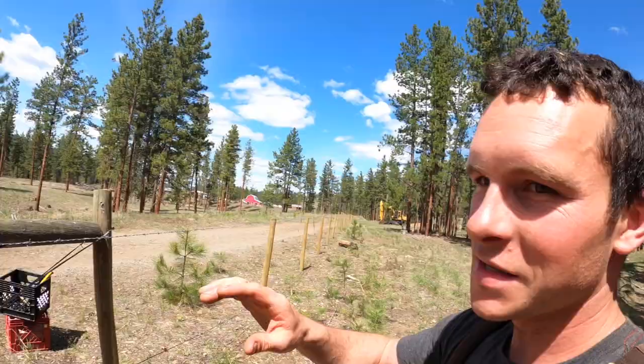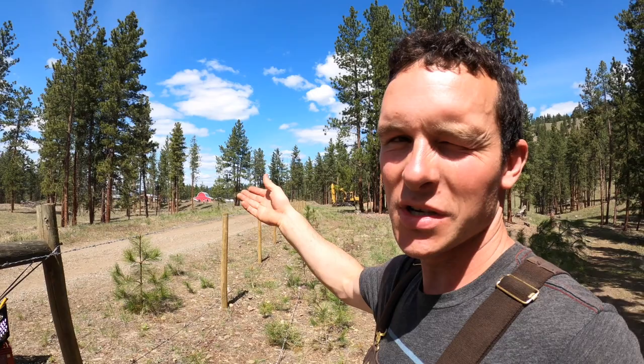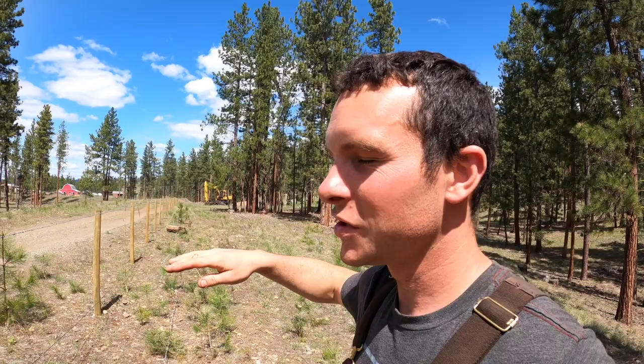We really don't know what we're doing — we're kind of making it up as we go along, just like we always do. So please don't watch this video to get an idea on how to do a barbed wire fence. I tied this end to the post, tensioned it at the far end, and we're going and measuring up and stapling like every tenth fence post. That gives us an average, and we staple all the ones in between — that way the fence doesn't go up and down for every little bump of the ground; it kind of has an average over ten posts.